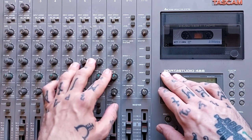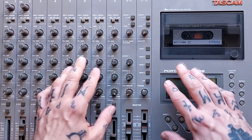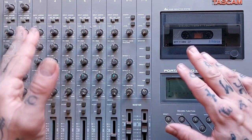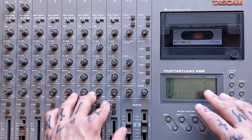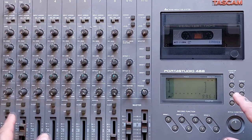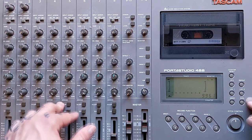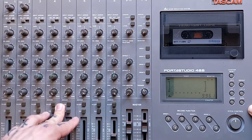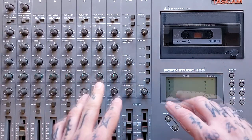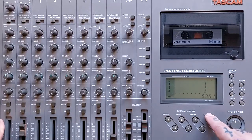Welcome to this video. I'm filming an introduction at the end of the process, but most of the footage you'll see was done as I was figuring out the problems. I wanted to give you a heads-up about what the problems were with this machine, because if you were following along you might think you're having an erase issue - and an erase issue I was having with this 488 is down to the cassette not making proper contact with the magnetic heads.